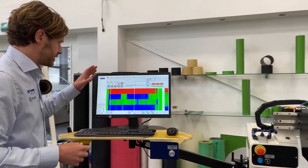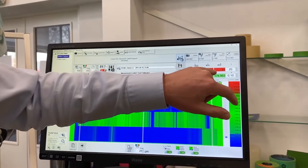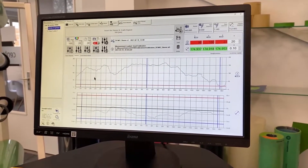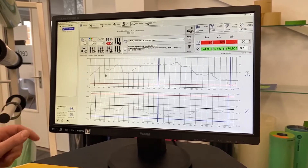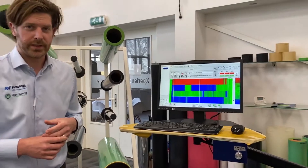So now it's done. As I said, it's quite a coarse measurement but you have a very good overview of your sleeve. You can also look into that in a bit more detail. This is actually the total TIR over the full length of the sleeve, and then you're ready to load the next sleeve.